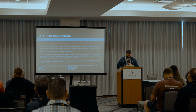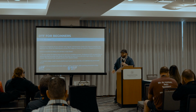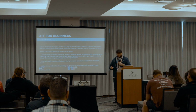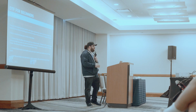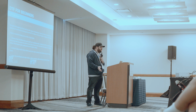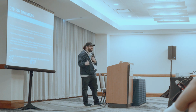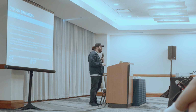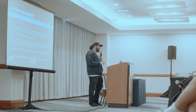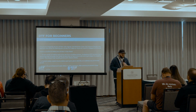Important daily also check, so this way, you know if you got any issue with your print heads. You don't want to start a production without checking this. If you don't check it, let's say that you print 100 prints, and then you're going to find out that those prints are not good. Those prints need to go to the trash. So that's money that you're losing and time. So you want to make sure that that nozzle check is 100% or at least 90% because it's going to give you a good consistency in colors.